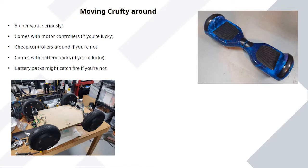And the reason they end up getting sold as spares and repair is because when they're used infrequently, like if you've got one for your kids or whatever, the battery packs slowly discharge through the controllers very slowly, and eventually the batteries get flat enough that they refuse to turn on and recharge. At that point, to the average consumer, it looks dead. The motors, however, are very, very robust and almost never damaged.